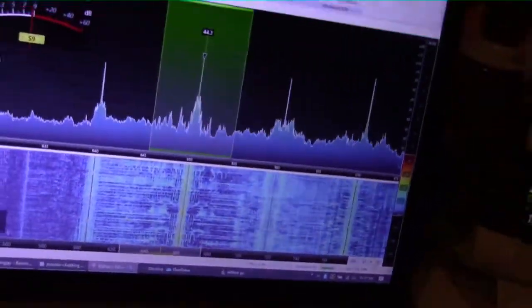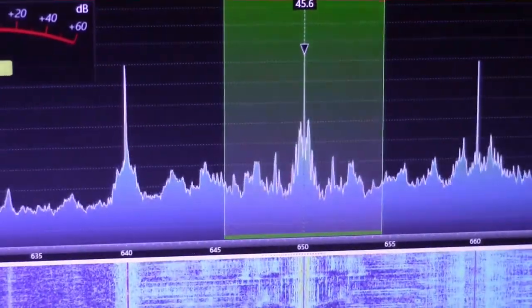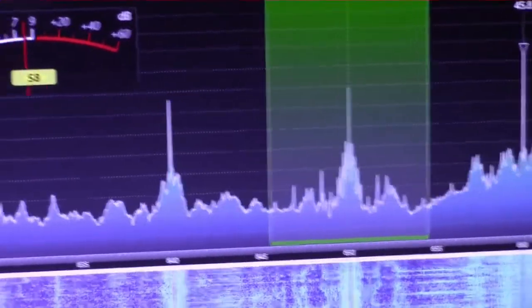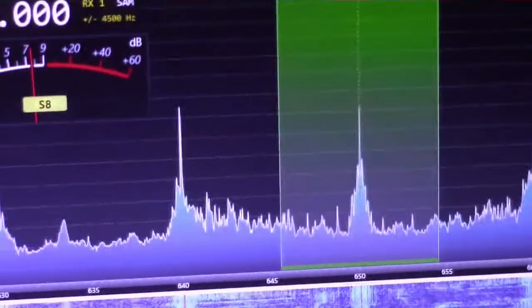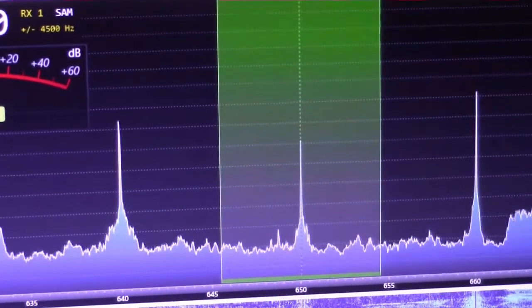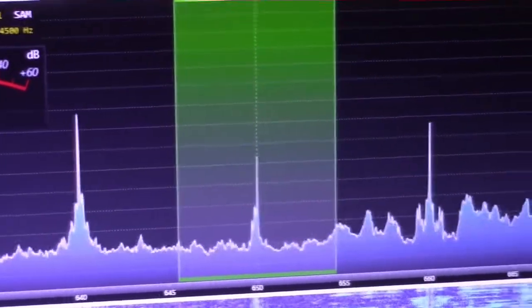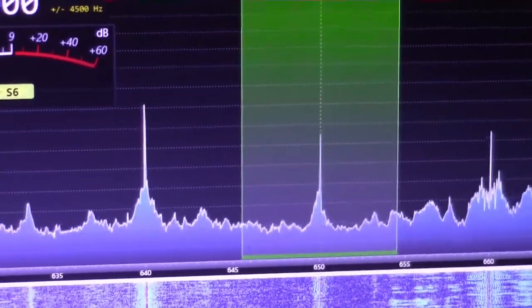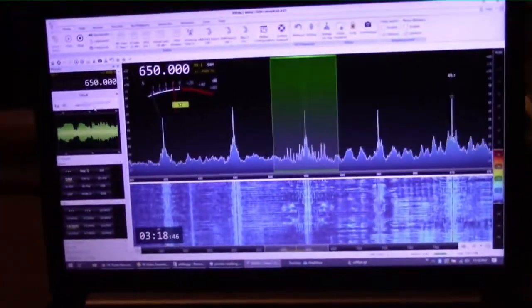And while we're on the passive antenna, let's go ahead and rotate it sideways. We'll see what kind of rejection we can get. Right about there. Pretty much put it where it's pretty hard to hear, right about there. So the modified loop antenna really does even better here up in the broadcast band. Now let's go up higher in frequency, see what else we can find.